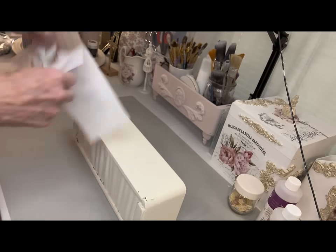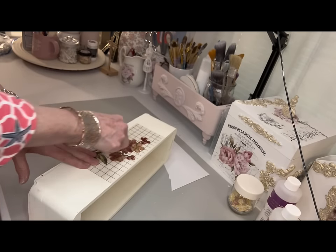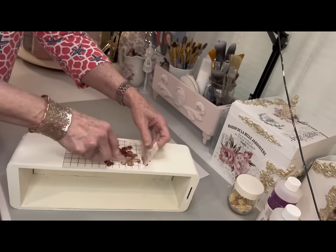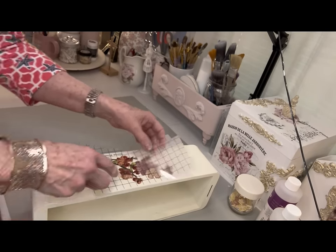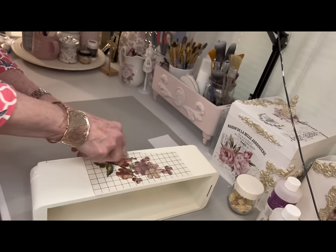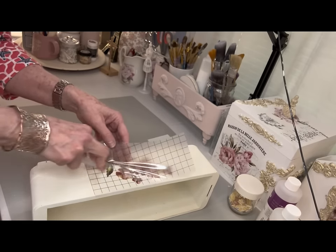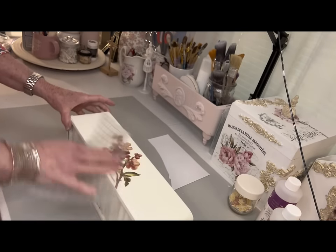My next piece is one of those old drawers that came from old Singer Sewing Machines. I've had it painted with Rust-Oleum Chiffon Cream for quite some time. I pulled out another flower from that transfer Lover of Flowers, and I have already sprayed it with Rust-Oleum Clear Sealer before I put this transfer on. Because if you don't put a clear sealer on it, when you put that transfer on, if you're not using a paint that has a sealer in it, a lot of times it will pull up that paint. So I always make sure I spray it first with clear sealer.